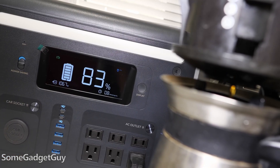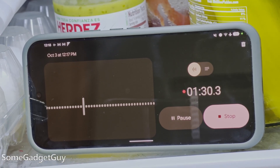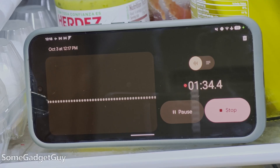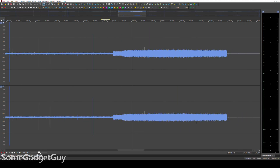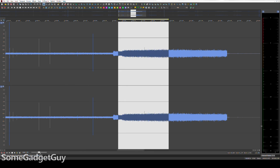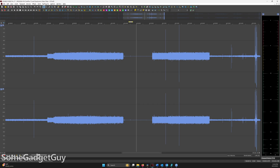I personally didn't have a watt meter when I was looking at a battery upgrade. I just wanted to see how often my fridge actually cycled. So I put a phone in the fridge for a couple of hours with the memo recorder running, and got an audio file that tracked the fridge turning on and off. My refrigerator has two stages of operation: the peak power draw from the label when it turns on is roughly 350 watts; in its higher cooling stage I'm drawing about a third of that, around 120 watts; and then it falls to a lower cooling stage at about 60 watts. I have three states to track: off, low, and high.